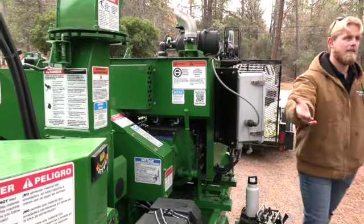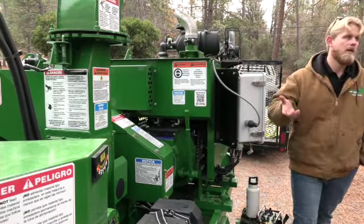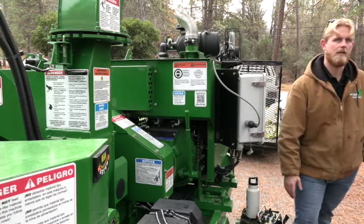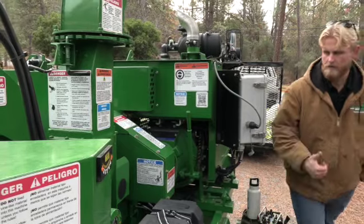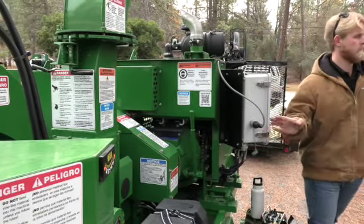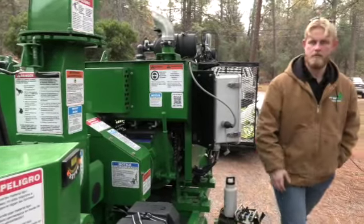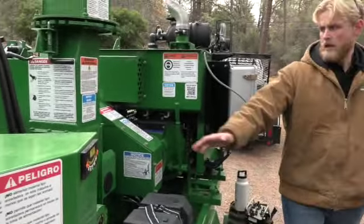That way, again, like Mike said, if you guys have turnover, a new guy comes on the crew, accidentally hits that, over-greases that clutch, and now you've got problems. So just make sure it's that one shot every 100 hours and you'll be good to go there. Any questions on the clutch? We'll run it here in a little bit, so you guys will have a chance to fire it up at the end and go over everything.